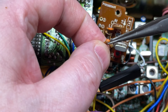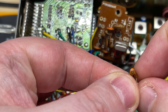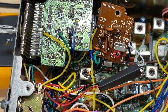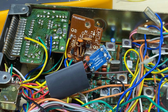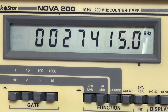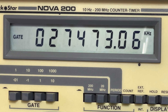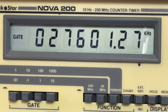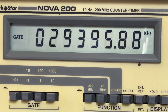I'm going to proceed with the modification anyway and see if we can find the fault later on. We just need to change one of these buffering caps for the crystal. We found the correct value of capacitor for the offset, and as you can see, it still works and everything looks fine. I thought everything was fixed, and then it goes again — we lose the high band.